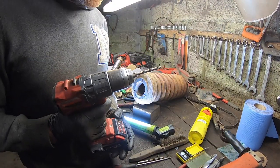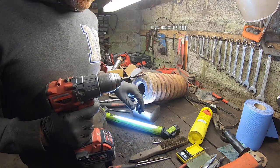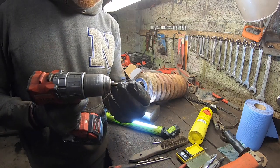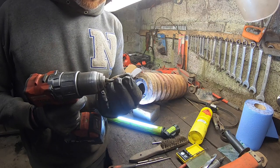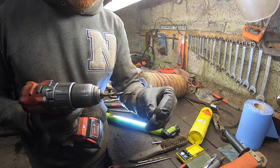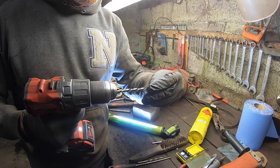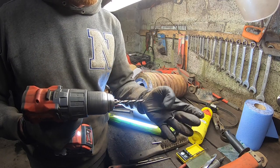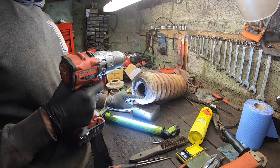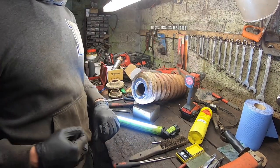So eventually, by drilling, it's an M8 hole, so by drilling it out 6.5 with a standard bit and then using the reverse drill to try and take out the rest, I got out the rest of the threads, as you can see. Actually looks like a helicoil, so I got it fairly central. As soon as the left hand drill went in, in the opposite direction, it screwed a couple of bits out, which makes the job a lot easier. So I'm going to work on that and get the next one out the same way. And yeah, hopefully we're good to go then.